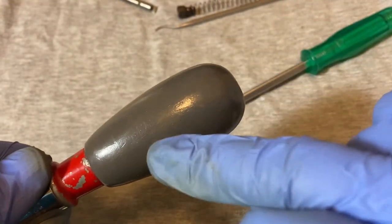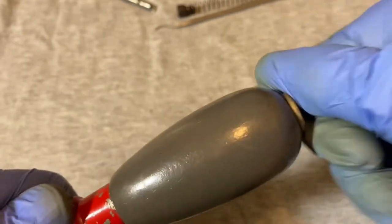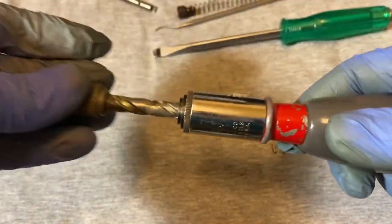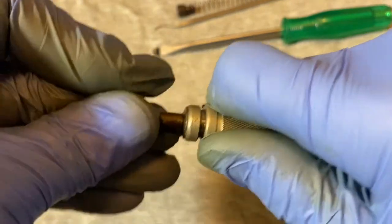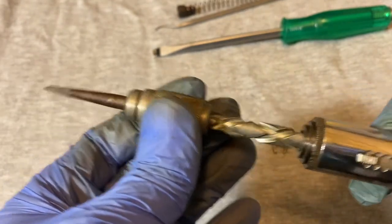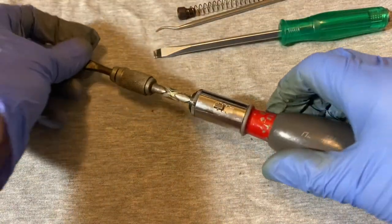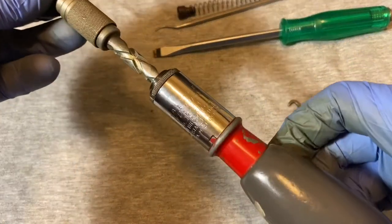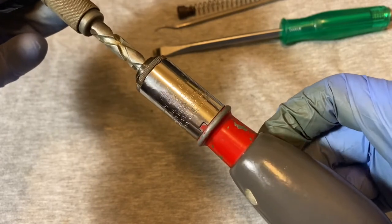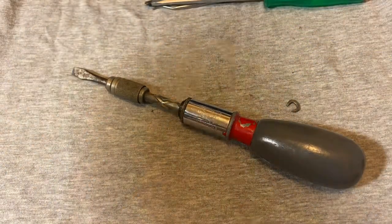When you get the clip back on the shaft, then you put the spring in — otherwise it'll just shoot the shaft out. So you screw on this cap, get your bit back in there, and that's how you put this together. That's the teardown of the Yankee Handyman number 133H, North Brothers, division of Stanley Tools, made in USA. Until next time, guys.